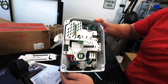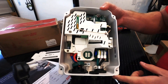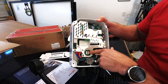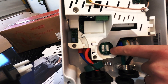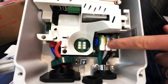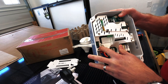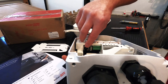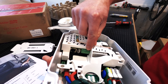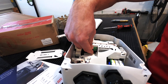The cover comes off. A couple things to point out: you'll notice that this can accommodate a cellular kit, so you can have this standalone — you don't have to have it necessarily connected to anything. These are LEDs, so these will light up on the front cover with a bunch of indicators. You could run onto it, take this off, pull out the wire, and actually hardwire it. We've got some dip switches right back here, an Ethernet port, USB, and then this is the RS-485 connection, which is how you get it to communicate with an energy hub inverter.